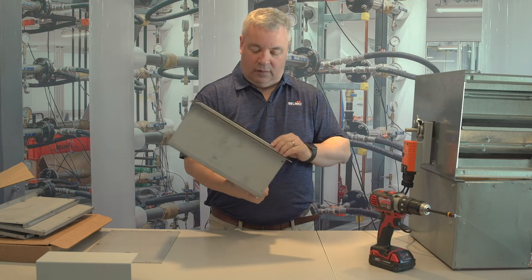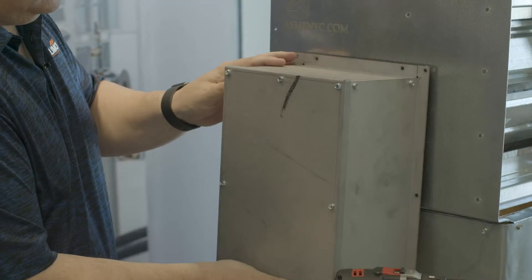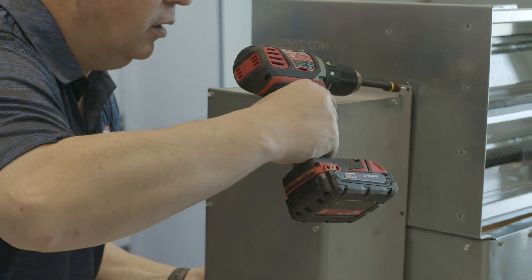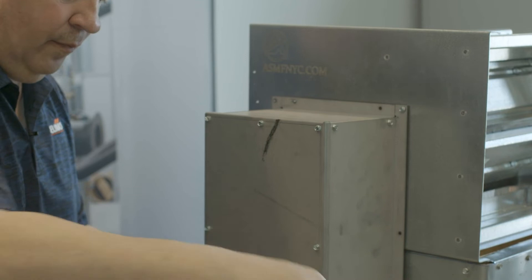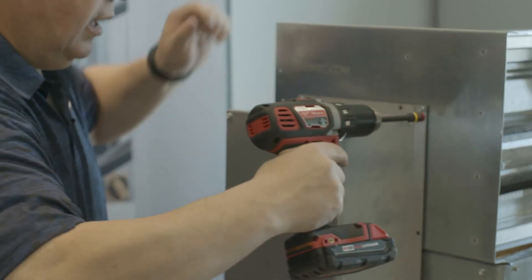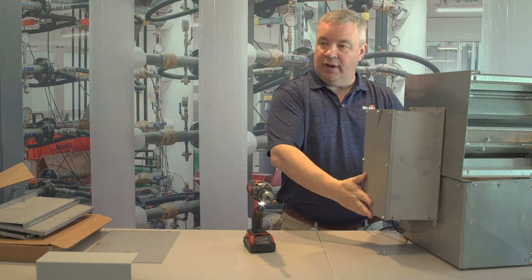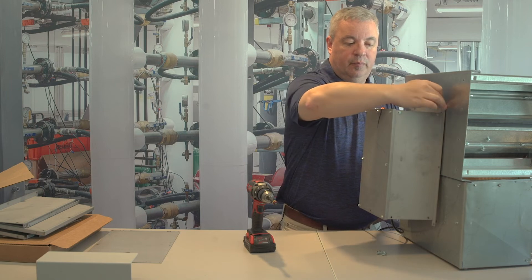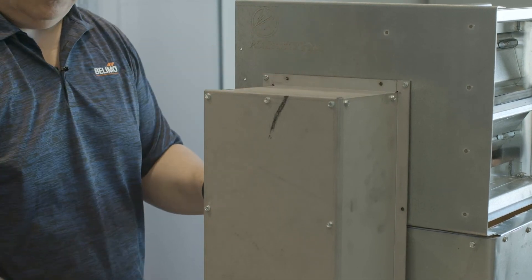This does not have a bottom on it. We install the weather stripping, and because this doesn't have a bottom, it's just going to go over the actuator that it's being mounted to. You can use sheet metal screws. Because this does not have a bottom and it is a kit, this has no NEMA rating on it. When you get this installed, take a caulk gun and put a bead of silicone caulk around it just to ensure that it is truly weather tight and you don't get any water seeping in.